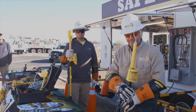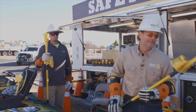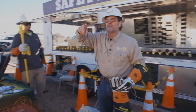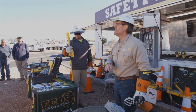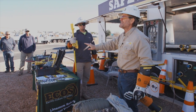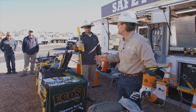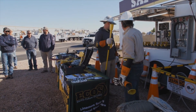With the reference in degrees mode on the A phase, we see a white light, confirming A is energized. This tool can phase transmission lines, a 120-volt receptacle, the high side or low side of a substation — you can phase any potential with this tool because it doesn't care about potential level. It doesn't matter what component of your system you're phasing; it's only looking at the phase angle.